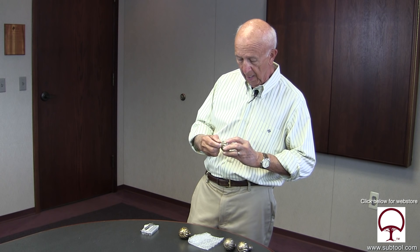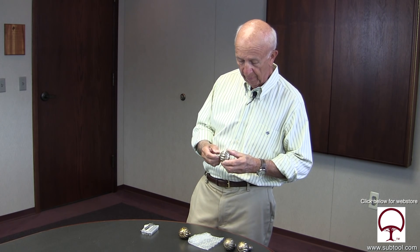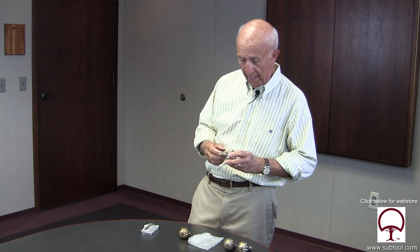But as you could see, we were struggling back there with the tap — that was not easy. The drilling was fine. Holding it was a bit of a problem. You may recall that in order to hold this without damaging it, I put soft jaws in there, which will somewhat prevent the damaging of the surface. The problem was, if you clamp it too tight, you're still going to damage it even with a soft jaw. And then it started moving on us, and that just wasn't good.